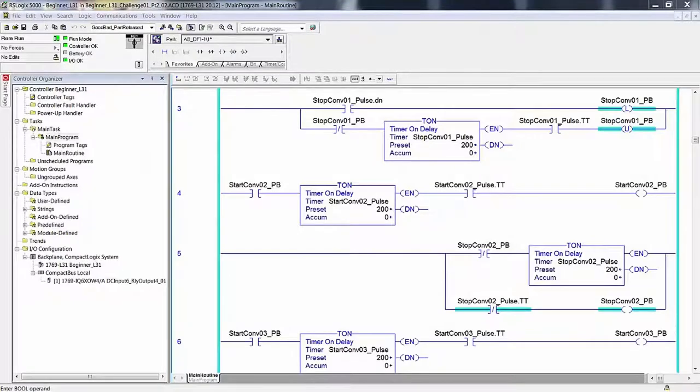Once is enough, the one-shot instructions. In the plains of RSLogix 500 land, there lives a MicroLogix 1000 processor. Although a very skilled processor, it is the least skilled of its family of processors. This controller was endowed with firmware that only supports one of the one-shot instructions, the OSR or one-shot rising.